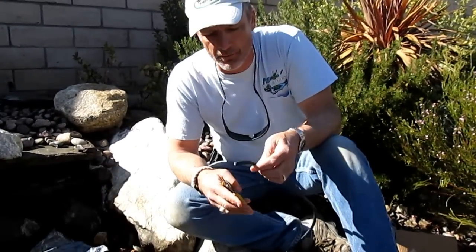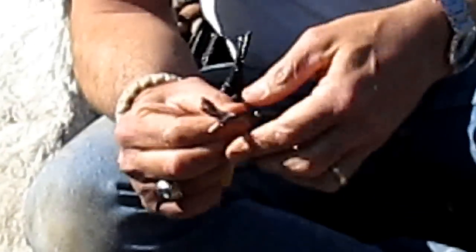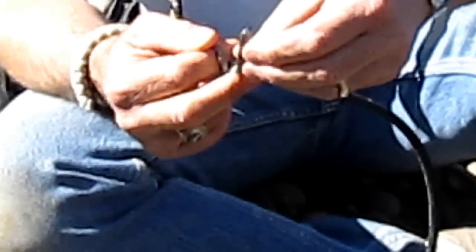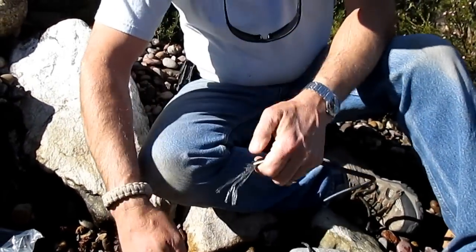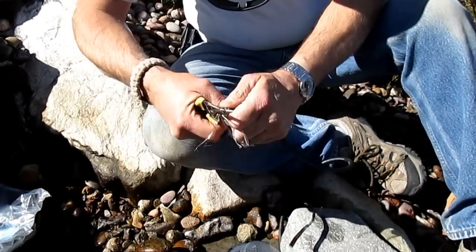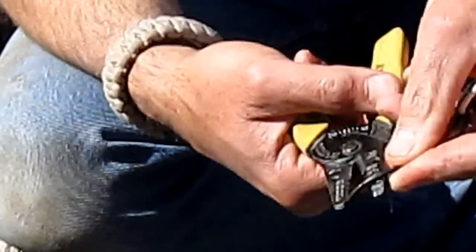I think we'll go ahead and make one of these connections first, and then we'll put the baffle plate in. Take your pliers — I like to use the Kleins. I'm not an electrician; we just do a lot of our own wiring. Strip back lightly, keep your trash in one spot where it's nice and easy. Strip back your wire, cut your excess off. We're approximately at 14-gauge wire here. I don't need very much to go inside of the butt connector, so I'm going to strip off just barely enough to go inside each one of the ends of the connectors.